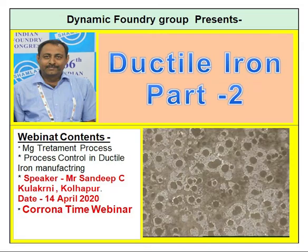Normally we do not give that much focus on sulfur and phosphorus in both cast iron as well as in SGI. So one has to give that entire focus on sulfur also, so that you will not miss it. If your sulfur is increased beyond your limit, then you have to increase the magnesium, or you have to understand why it is increased. That is very important. You can increase the magnesium and say that the treatment is okay, but why it is increased, so that next heat you will be able to control it. So it's very important to understand first that it is increased. So you have to give focus on your bath sulfur as well.